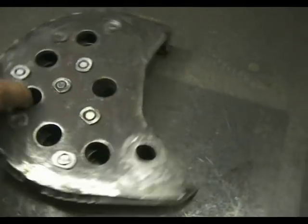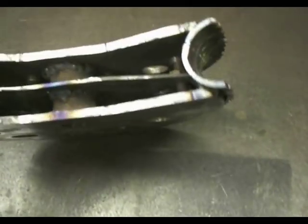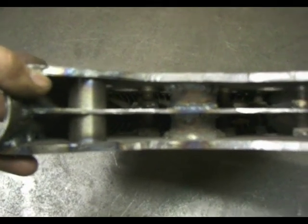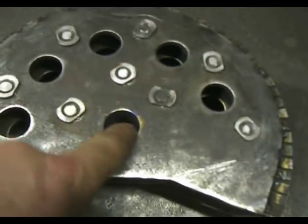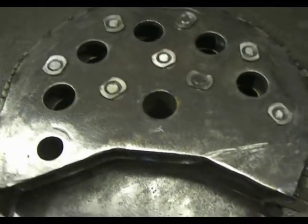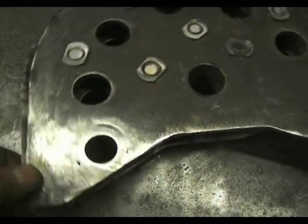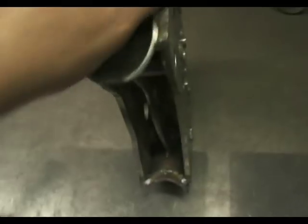Here it is all bolted together and tacked together. As you can see it's made out of 3 separate levels — the top and bottom sheet is 6mm, the centre section is 3mm. This is the pivoting pin when it's in one type of bender, and there will be a flat plate welded on here for the push bender. This is the locking pin. I'll show you it from the side.